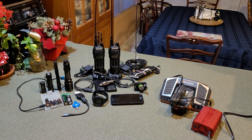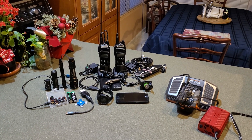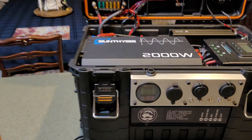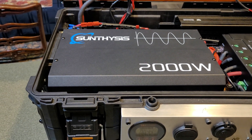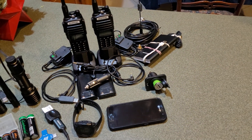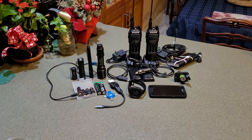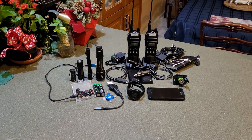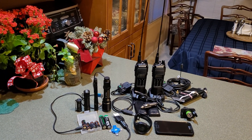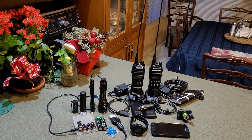When you start thinking about what you really need, keep it 12-volt DC only. You don't want to use a power inverter because any time you go from 12 volts to 120 volts there are losses. This 2000-watt inverter will pull one and a half amps just running idle. Everything here can be run off DC. Also, a DC fridge is really cool — it pulls about 4 amps and could run indefinitely with 200 watts of solar panels and a lead-acid battery of about 90 amp-hours.